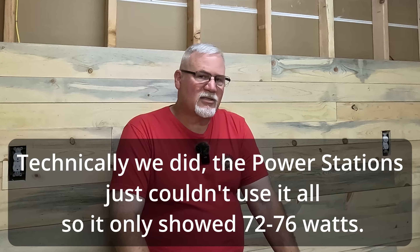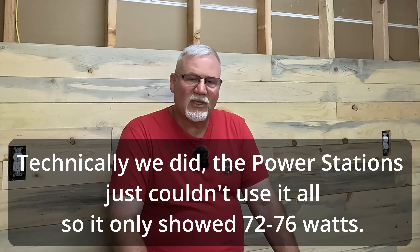I've actually gotten more wattage out of panels than they're rated for — but that was in the wintertime when it was super cold, super bright, super sunny, super blue sky. When all things line up perfectly you're going to get maximum wattage out of them. But manufacturers rate them kind of like — well, we know we can get this much out of them, probably going to get 10% more than that under the right conditions. It's just like cycle life of batteries — manufacturer says they can get this many cycles, but it's in a controlled environment. Same with the panels.